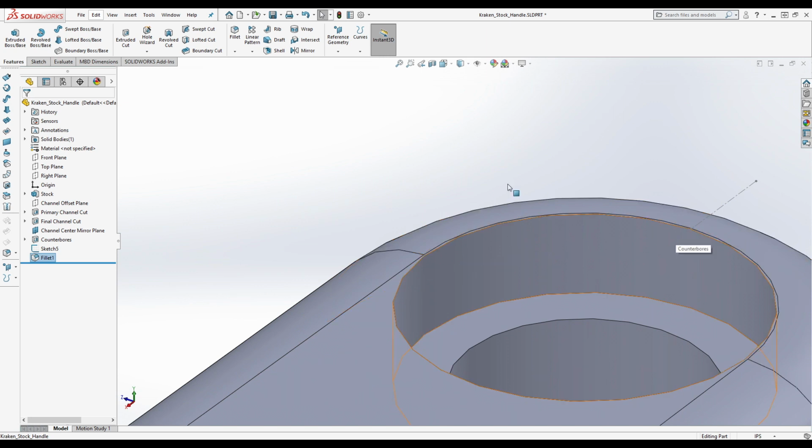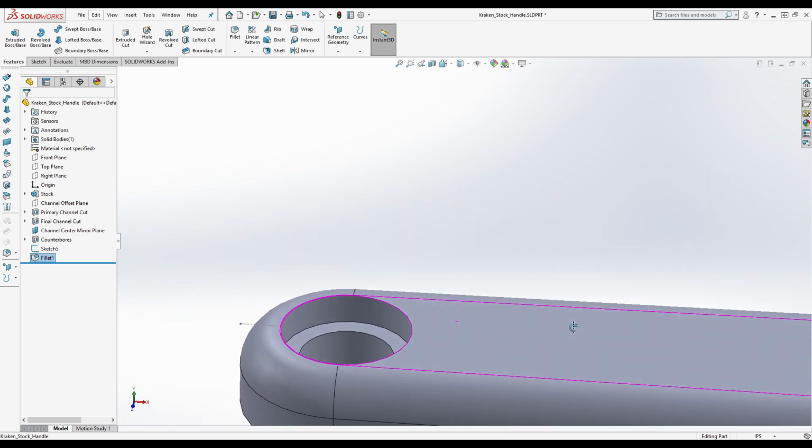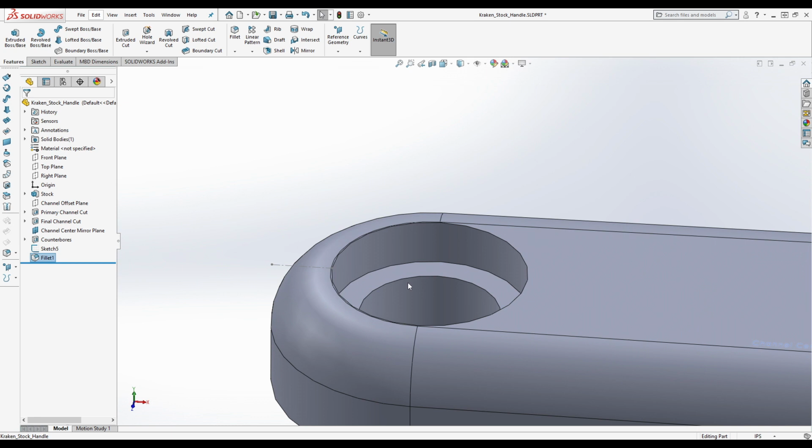It's just, you've got to be really careful when you have lines that get really close like this, because it can make it tough to do certain operations sometimes in the CAM software. So that's what he's doing here, just so you guys know. He's using a 2 millimeter corner radius end mill. You can do that, or you can spend a bunch of extra money on a custom 0.08 inch roundover bit, but he's probably not doing that.